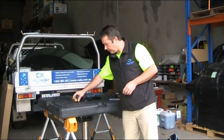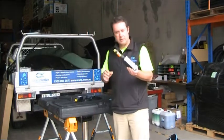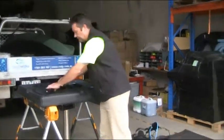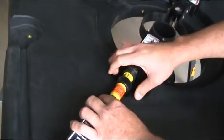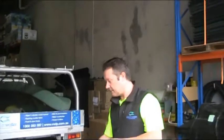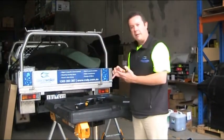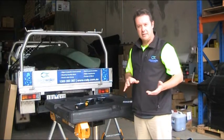It also has an electrical quick disconnect on top. The opposing connection runs out to your mains power supply and simply connects onto the float. You just hand tighten that once it goes in and you've got a watertight connection. That's very useful when you want to do maintenance — you just come along, disconnect it, pull the pump unit out, and you don't have to drag the float and wire all the way back to shore.